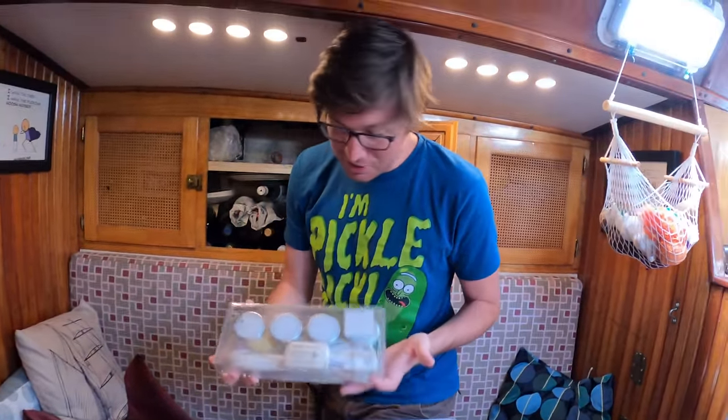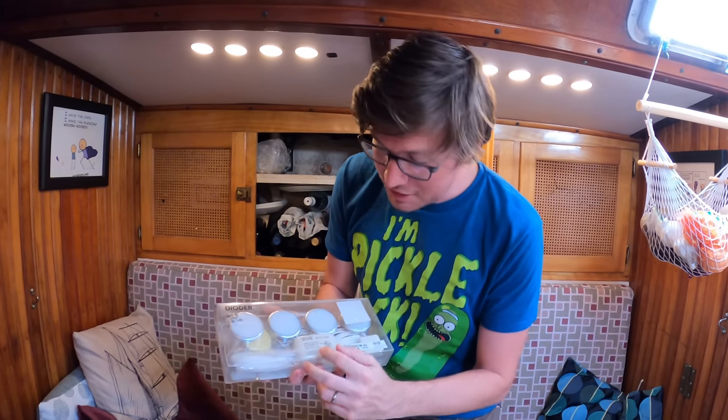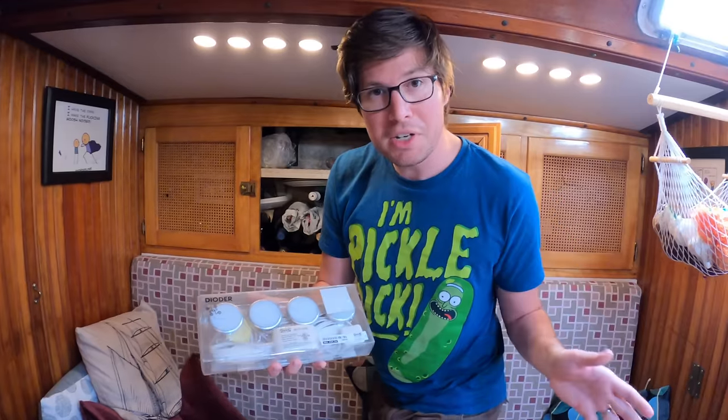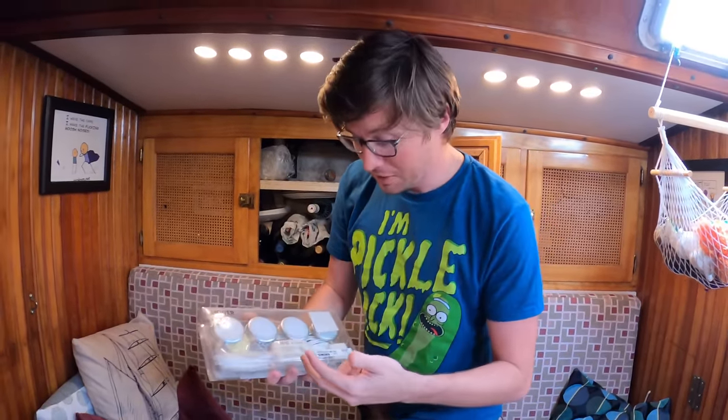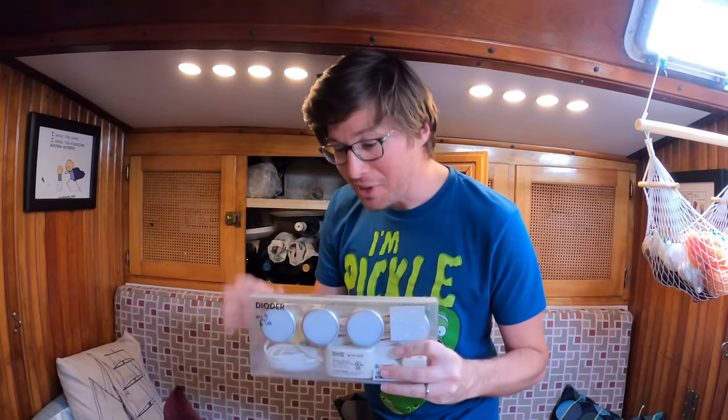So I bought a bunch of spares — lots of them. These are eight years old, never moved from the box. A super important cool part about IKEA LEDs is the input voltage is whatever country you bought it in, but the output voltage is 12 volt DC. So we just cut off the little transformer box and wire it directly into the boat's battery bank. And these are really cheap — eight years ago, a box of four LEDs was $20, while a single marine LED was $150.